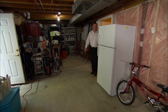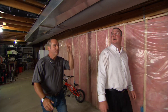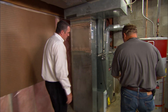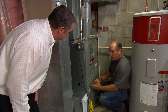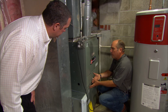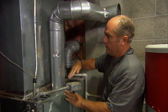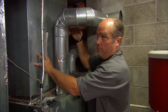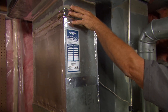Alright, so you've got a long and very clean basement. Here's our main trunk. Looks like an oil-fired furnace, so you've got a burner right down here that fires into a chamber and heats up the air. There's a blower right here that pushes the air up across a heat exchanger. There's a cooling coil back here so the air can go across a coil to be cooled in the summer, and the air goes out through this plenum right here.